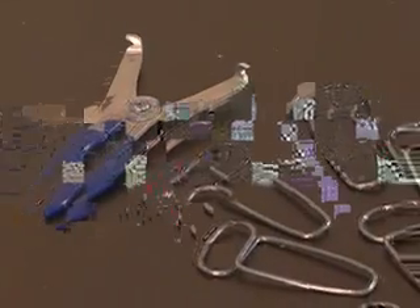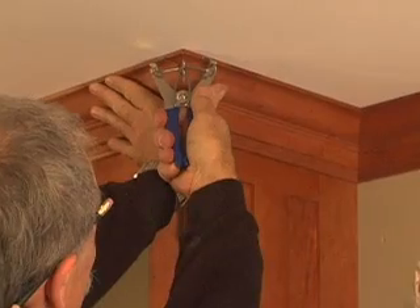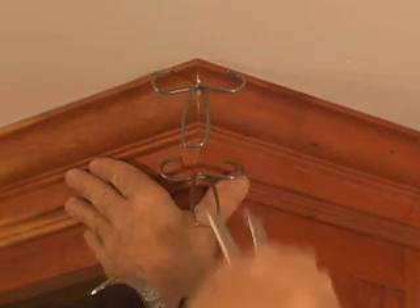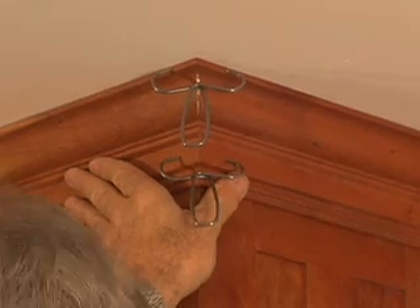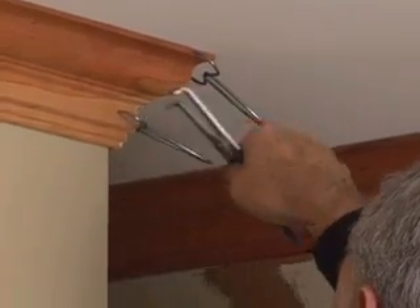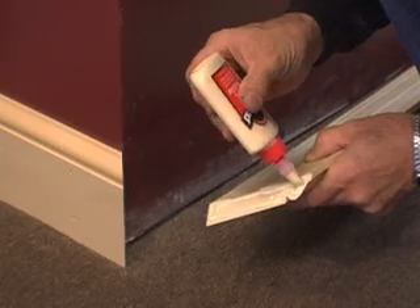In finished carpentry and woodworking of all kinds, miter clamps are essential for superior workmanship. Miter clamps keep squeezing while the glue is setting up. Joints will not swell open when miters are clamped, so it is not necessary to back cut miters when running moldings.